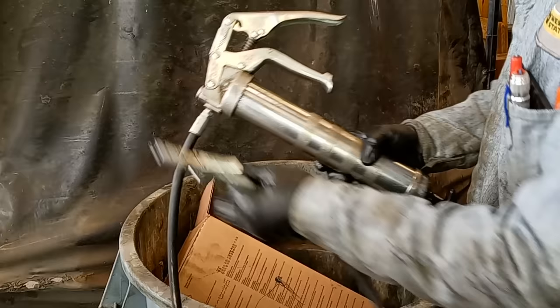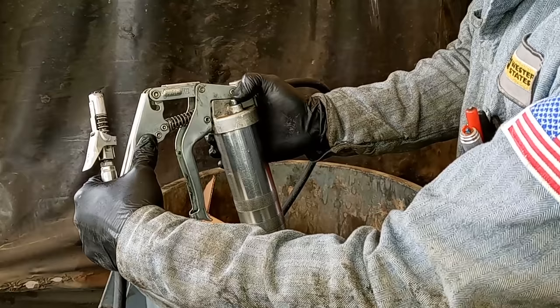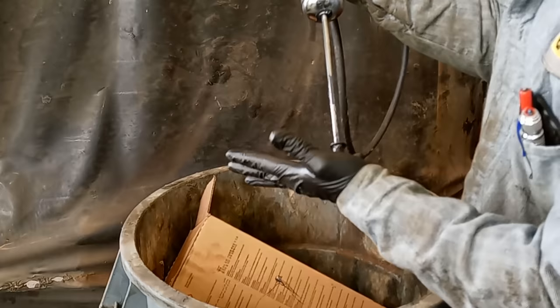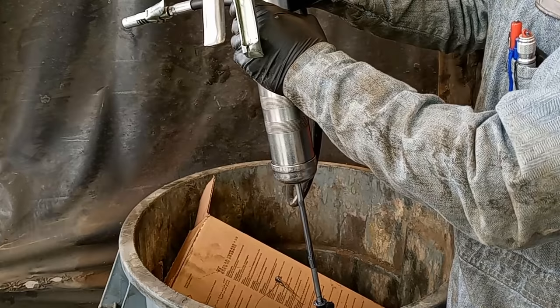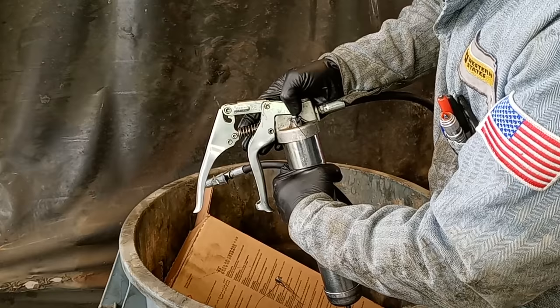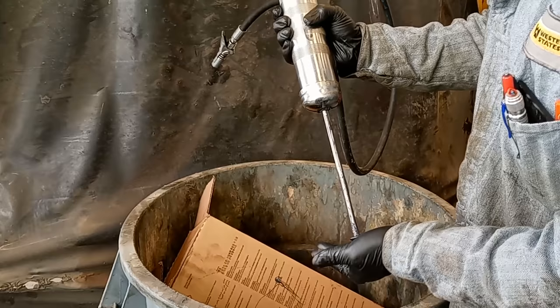There are two ways to purge the grease gun: there's the pipe thread style, or there's a one-way check valve that's better for air purging. The spring plunger isn't very strong, so it's hard to force air out if you do get an airlock. But the shaft can actually be made to force that plunger up — if you fully extend it out and rotate it, it'll actually lock under the plunger, and then you'll be able to force grease out of that air purge. What I usually do is lock it and then force it on the ground and hit that one-way check valve. If there is air in the grease housing on top, it'll force it out. Here I'm pushing it against the side of the trash can — it's putting a lot more force on it than the spring does, and you can see it's actually pushing a good amount of grease out of that little one-way check valve. If there was air there, it would force it out. Once it's forced out, all you have to do is pop your plunger rod back in.